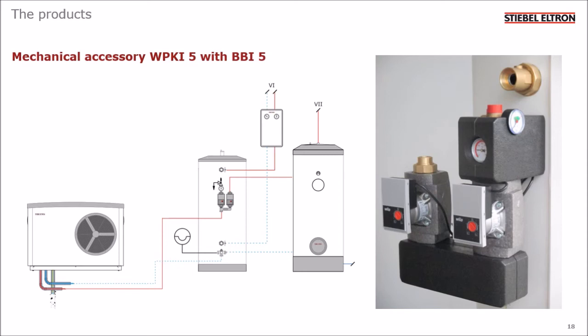One thing to note, if the water is being drawn backwards through one of the pumps shown here, the ring of LED lights goes red. Even if there's no electric power to the pump, the impeller of the pump acts like a little generator that makes enough electricity to light the warning LEDs. And this happens if one of the non-return valves fail, usually because it has something stuck in it.